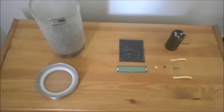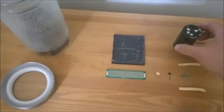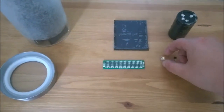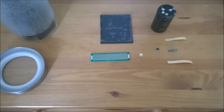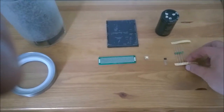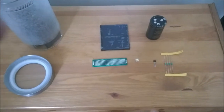Here's what you need for the light: the IKEA DRÖMMAR pot, 3 euros; a solar cell, 1 euro 30; a supercapacitor, 4 to 5 euros; an optional circuit board, 20 cents in low quantities; an LED — an efficient one is 20 cents to 1 euro depending on where you buy it; the IC, the QX5252 or similar; an inductor — or a one solar cell, one capacitor configuration — you need about 800 microhenries.